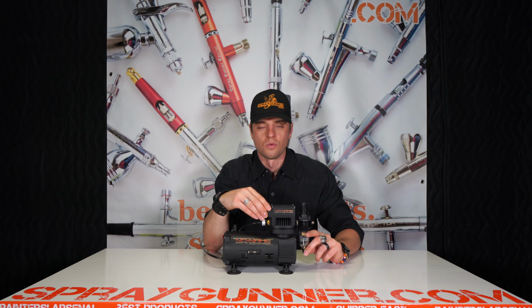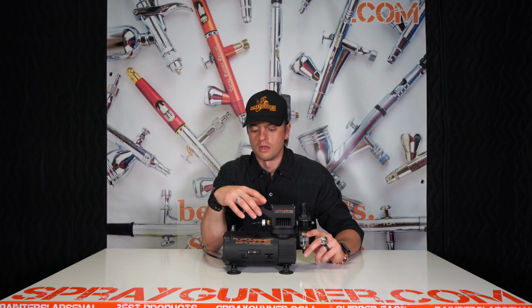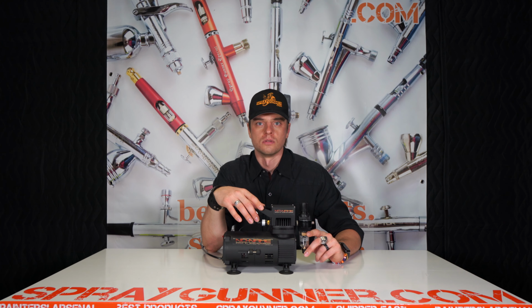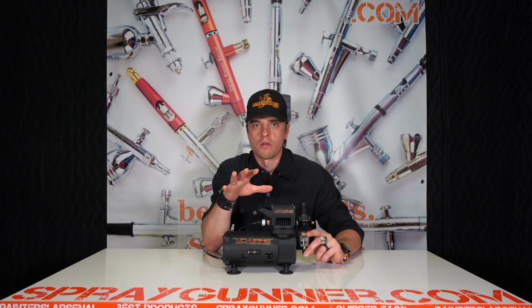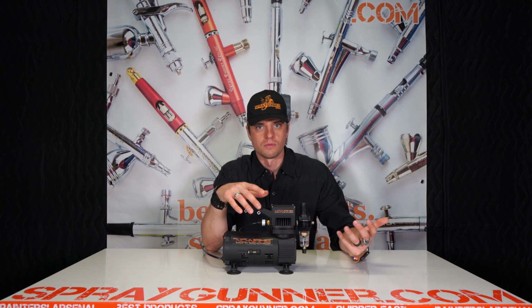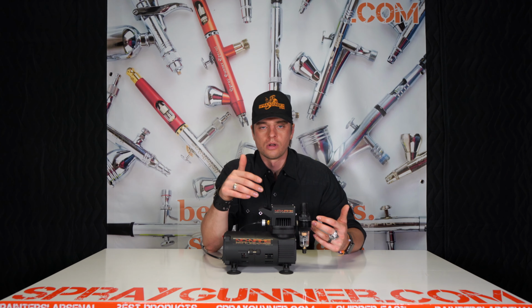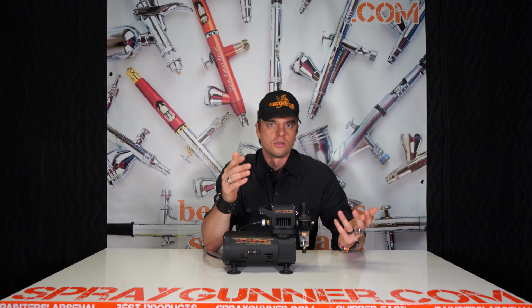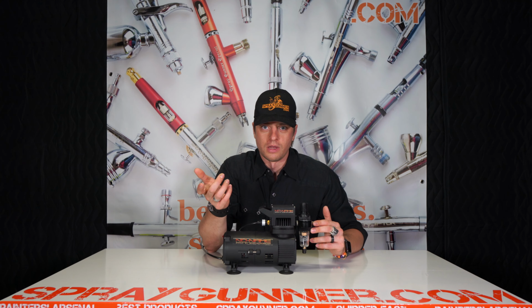But if you have the no-name by spray gunner sticker like I have here, this was applied by Isoberto. We have other trained, qualified employees who know how to run this compressor, how to listen to it, how to see how it builds up the pressure, check the auto on and off function, and just make sure everything sounds and feels and looks right. It builds up pressure up to 4.5 bars, then it shuts off automatically, and when the pressure drops to 3.5, it starts again. When you connect it directly, without an air tank, you start using the airbrush, pressure drops immediately, and it kicks on. If you stop using the airbrush and release the trigger, air is not flowing, the pressure builds up quickly, and it shuts off right away.